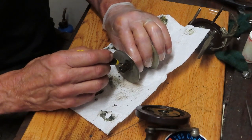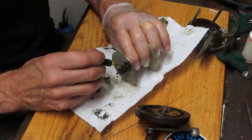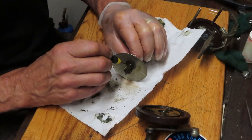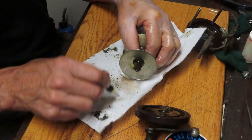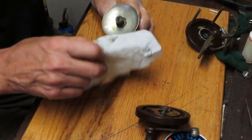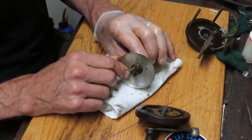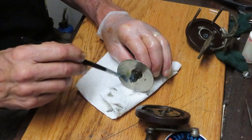I'm going to a small micro screwdriver — probably not a good idea, as you'll wind up wearing the sides of the blade, and when you have a very small screw it may not grab it properly. You can also use a blade from a utility knife, a toothpick, or other things. When you're satisfied that you've cleaned all those grooves, check them to make sure they're all uniform, not bent, chipped, or distorted. Then we can go right back in with some fresh grease.